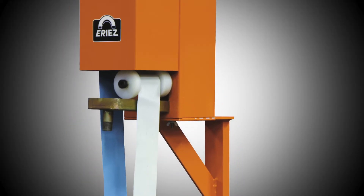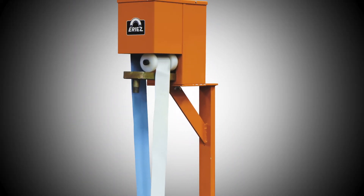Tramp oil. Now, tramp oil — what are you doing about it? Any skimmer, no matter what the type, only works if there's oil floating on the surface. And typically when the machine's running, everything's being pumped and splashed, and you don't see any oil. It isn't until the machine shuts down that the oil has a chance to float to the surface in the tank.